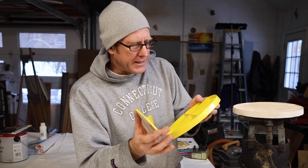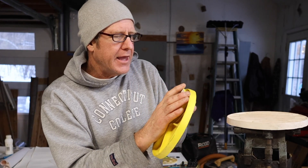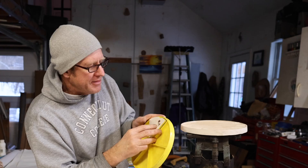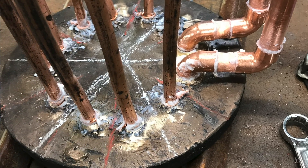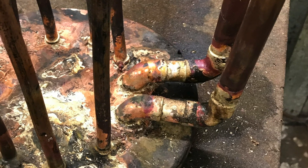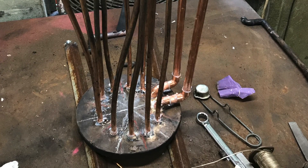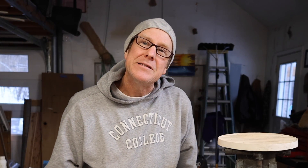I came up with a new idea — and this is the pattern used for sand casting that is the winning design. I have all these little wedge-shaped pieces that get welded in after this is cast in bronze. Each one of these wedges makes a V-shaped chamber. That V-shaped chamber gets connected with a loop of pipe all around, with the in and out on this side. The fluid goes in through that pipe to the next chamber, around the point, down through the coil, into the next one, around and around — collecting that heat and bringing it down into my domestic hot water.